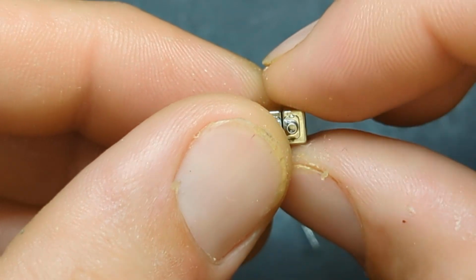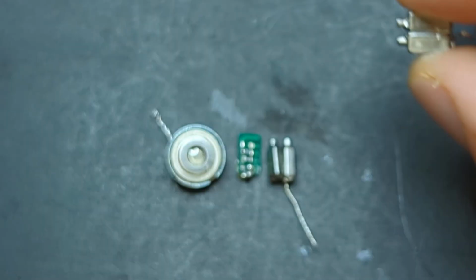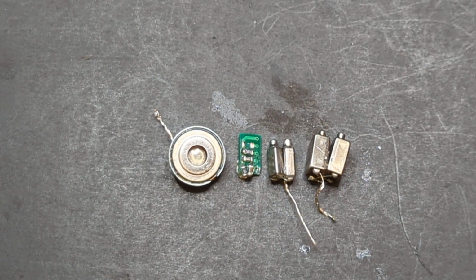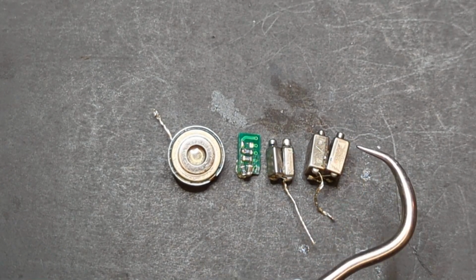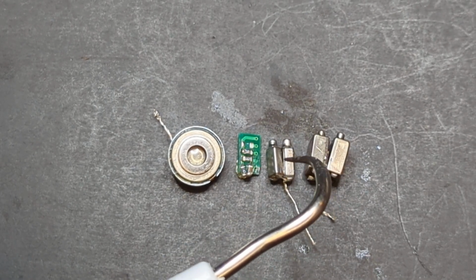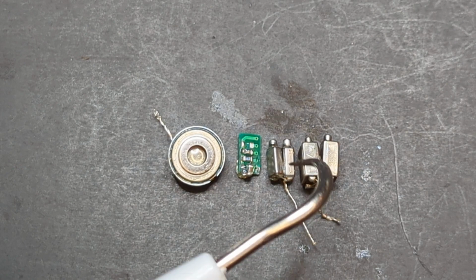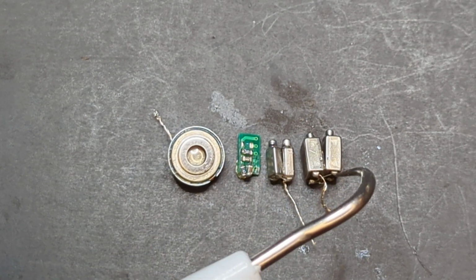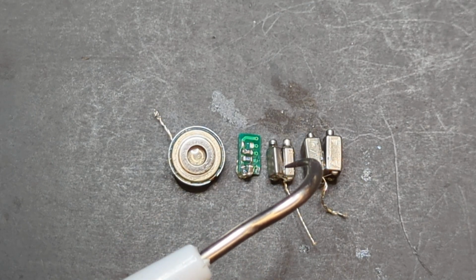And then just to recap, we have two Sonion drivers. So yeah, very nice. This is essentially what you get in the GS Audio GD5. So we have our two Sonion mids, which is very surprising to see. Two e-audio treble BA, which is kind of disappointing. If they're going to use such high quality mids, why not use cheaper mids? Because the midrange doesn't matter as much as the treble. They could have easily used two e-audio mids, and they would have sounded just as good, if not maybe better, than these Sonions. And then use Sonion or Knowles for the treble BA.